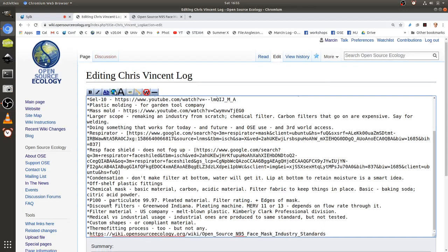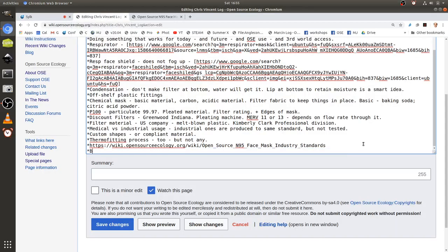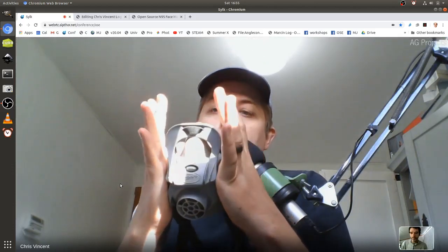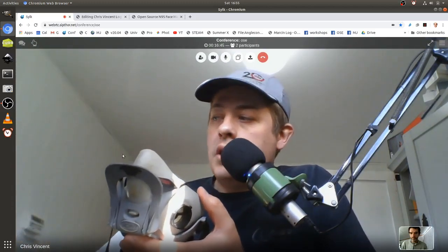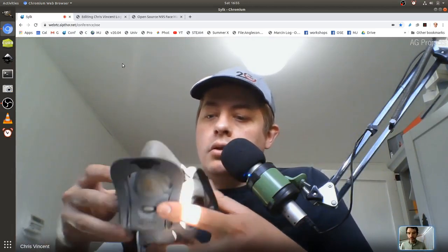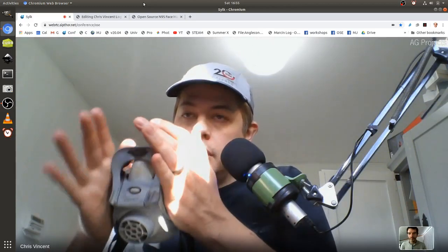In industry, you have to do leak tests using banana essential oil, because it's the strongest smelling essential oil there is. You do leak tests and make sure you can't smell anything, because if you can, it's leaking around the filters. You can clog up the filters like that, and you can do a blow and suck test as a simple method. With the organic filter cartridges, you're supposed to do a banana oil smell test weekly. Even with the filters on, you can put your hands over there. The basic idea is you either suck or you blow. So for the inlet, you do this.